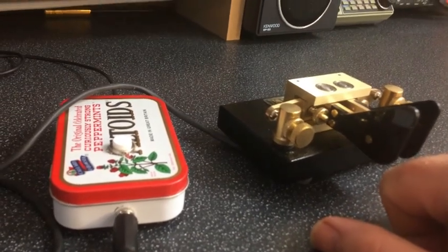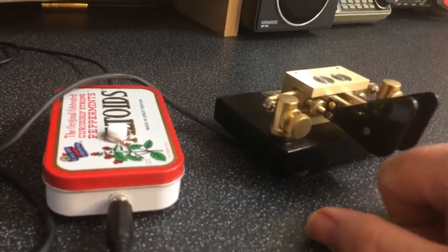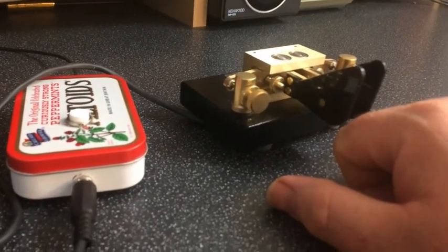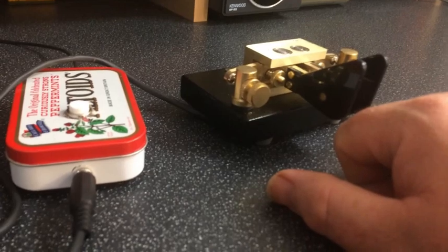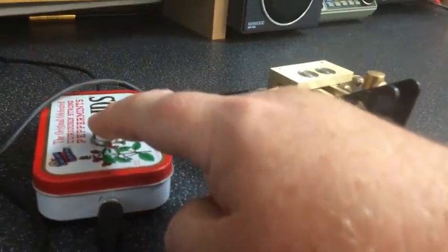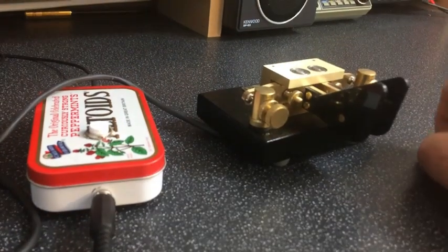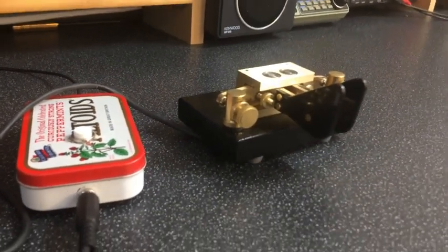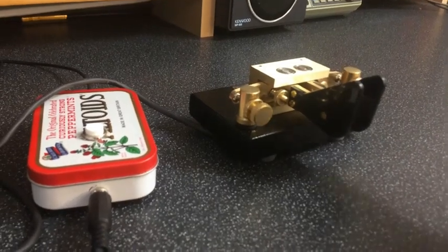That's how we alter the pitch. If you need to tune on your radio — an auto-ATU or manual ATU — and you want a 20-second carrier for that, we send the letter U. We press that button and there you go, we've got carrier for 20 seconds, or you can just touch a key to stop it.